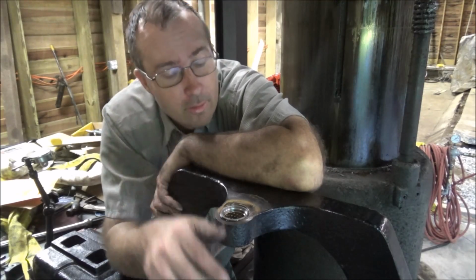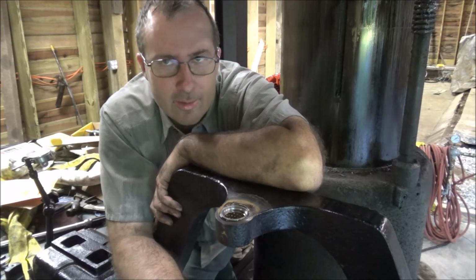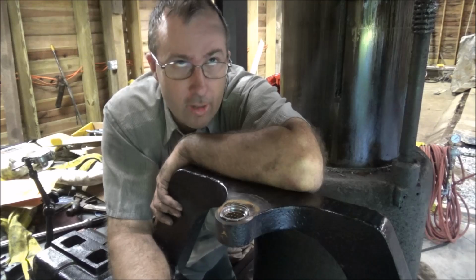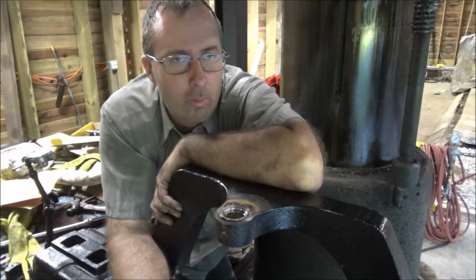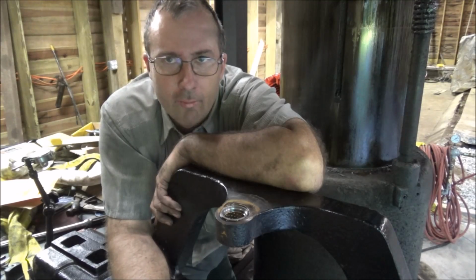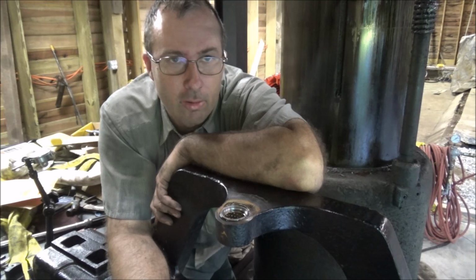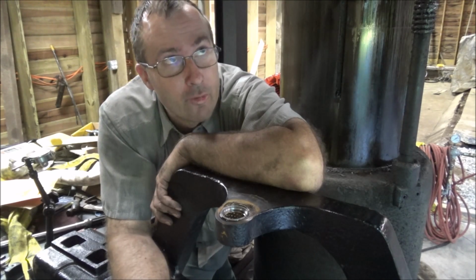I need to check on this spindle and see if I can tighten it up a little bit. That's 7 thousandths of bend with it stuck out here, with me shoving on it as hard as I can. It's probably not a whole lot. I don't know. I haven't really ever checked a spindle on like a Bridgeport or something. If it's stuck clear out, if you shove on it hard, how much does it bend?